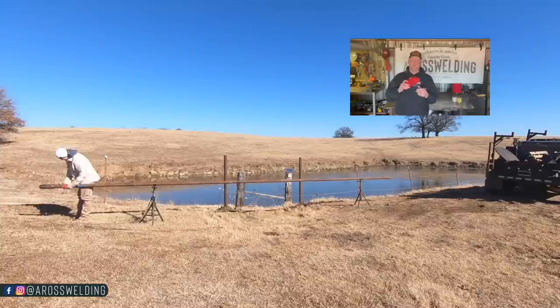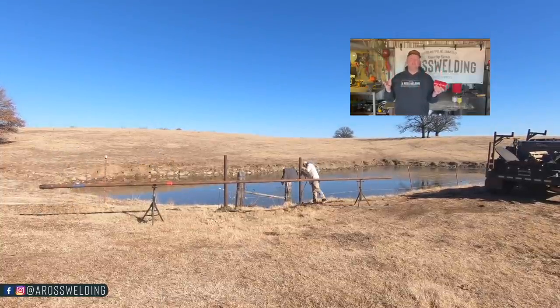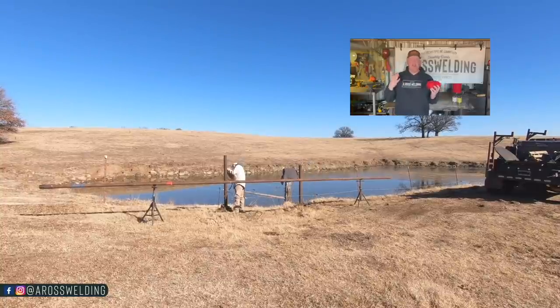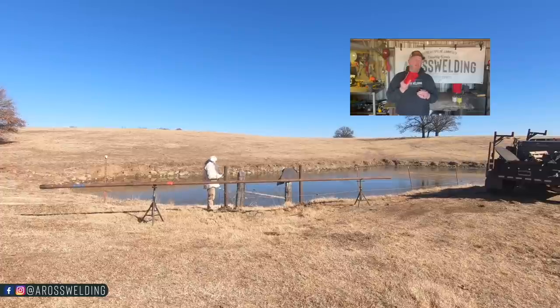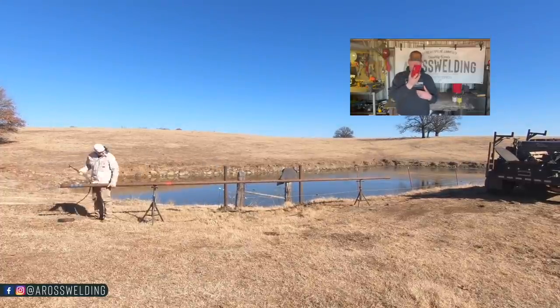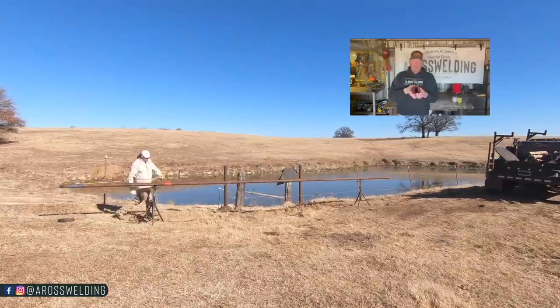All right, so how do I keep my saddles directly lined up with one another? So they actually make a tool called a center finder, and you can use that, but on fence, I normally find it faster and easier to just eyeball it. Sometimes I use a template, sometimes I don't, but the most accurate way is to use a template, and I just cut one end of my saddle, and I roll the pipe.